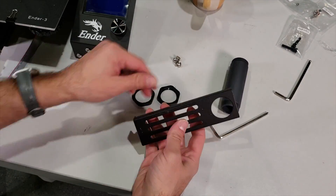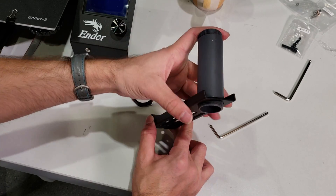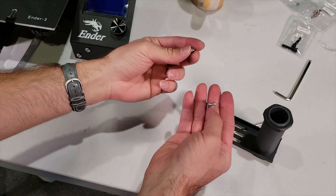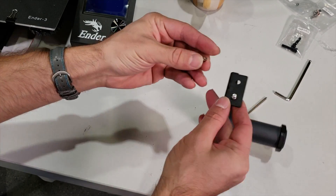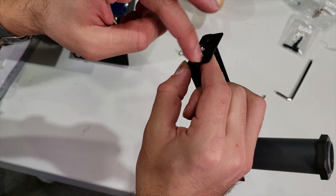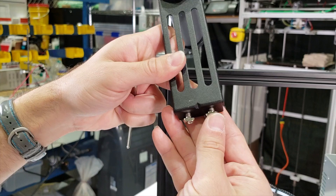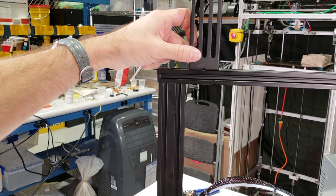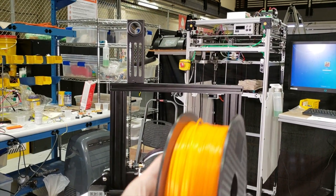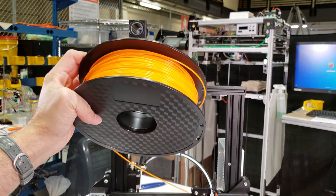At this step we are going to connect our filament holder. Get these — it is going to be connected like that. Put our bar in as you see, and put these plastic nuts on it. We are going to use our metric 5 25mm fasteners with T-nuts and connect the T-nut in this direction. Now plug this one in on top of my printer, align the T-nuts and insert them from the top, then fasten it. I'm going to put my Halloween special orange filament on it too — we are going to print some pumpkins with it for the next video.